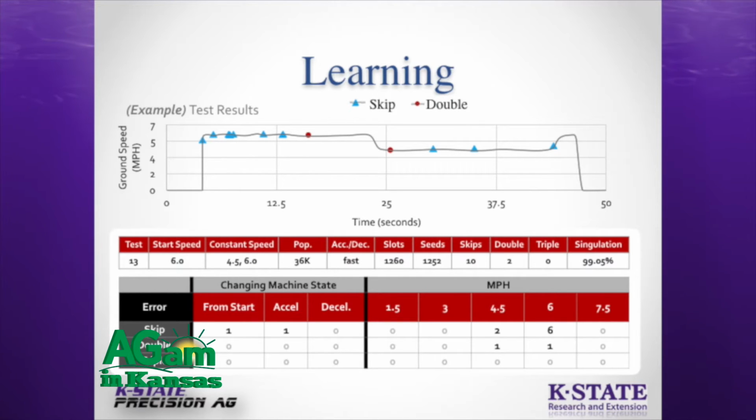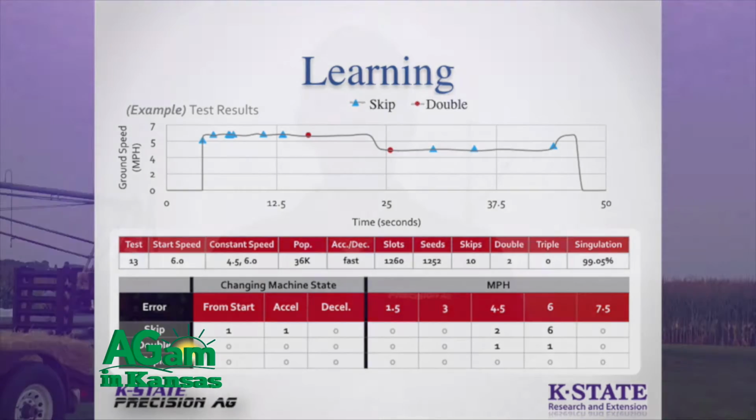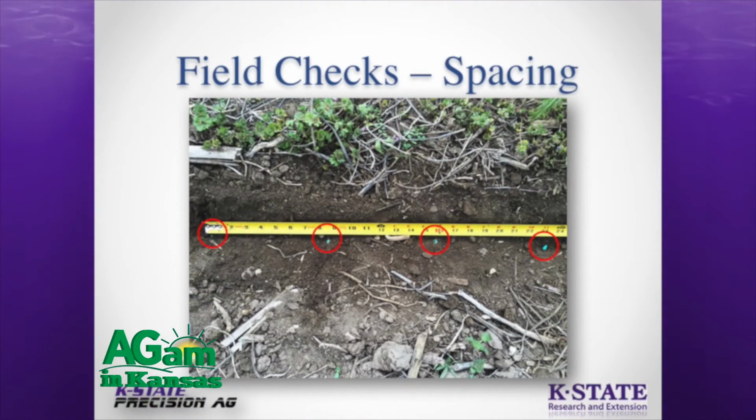So overall, that is the aspect of the electric seed meter, which gives us this functionality. We also learned that we can implement turn compensation. That means if we are planting on contours or when we are turning around the corners, every single row is planting at the same spacing as you would like. That means every meter is moving at a different RPM based on its own speed on the ground. So we can maintain much better plant spacing even on the turns as well.